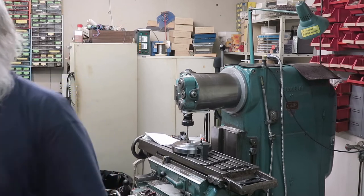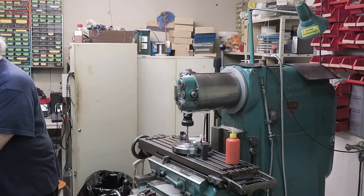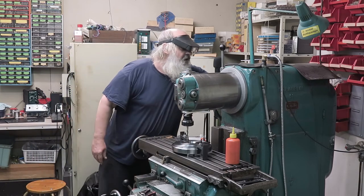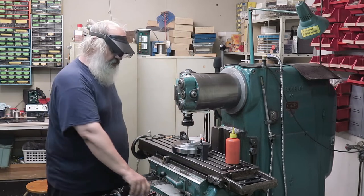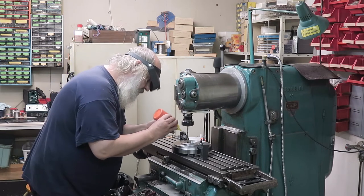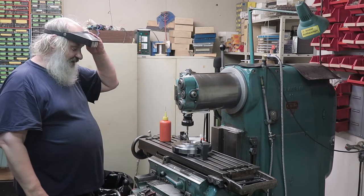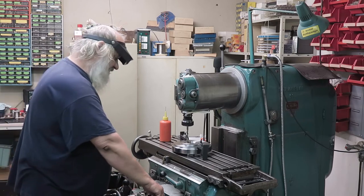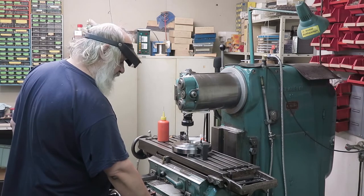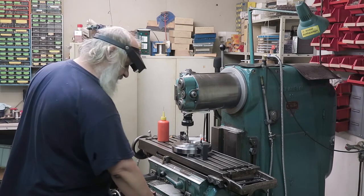Okay, so we start drilling. I'll take some cutting oil, the papers away from here, some eye protection in case it will throw chips. Then we put this in low speed but high gear. Let's see how it feels. Okay. Feet on. The old milling machine is starting. The feed motor is picking up speed. We can do that now. So, what I will do, I will buckle this. I get one round at a time and stop, round and stop, 13 times. So, first round.